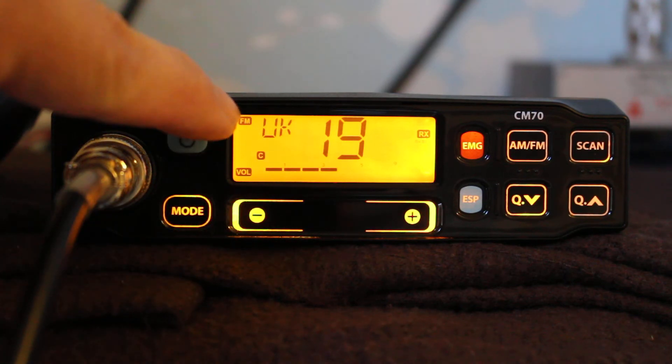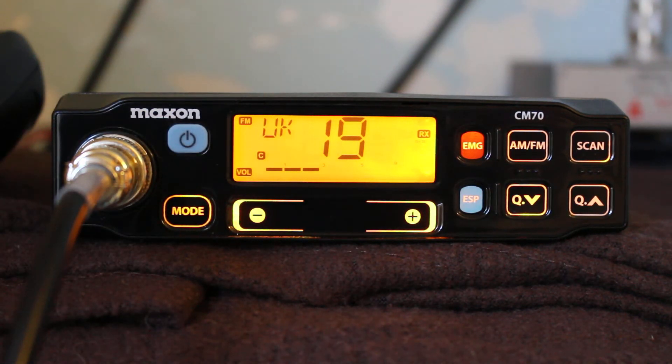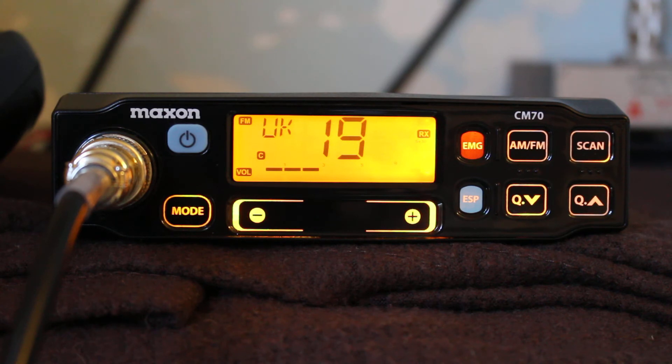It says UK there because it's on UK bands at the moment. What I'll do is restart it into what you would call export mode — it's really PO mode. The RU mode gives you 10 kilohertz channels with steps that end in 005 or 5 kilohertz, but on 10 meters you really want them on 0, 10, 20, 30, 40 kilohertz steps. So that's the PO band, which I think stands for Poland, though it's not the official Poland allocation.